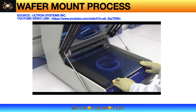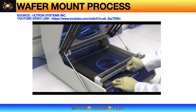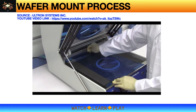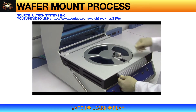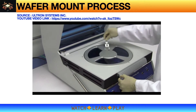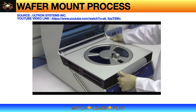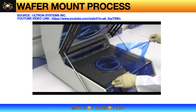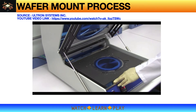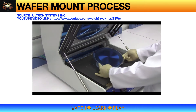Next, pull the laminate roller assembly completely forward and return it to its home position. Close the lid and rotate the circular cutter 360 degrees to cut the film along the film frame. Slide the end cutter, open the lid, and remove the excess unmounted film. Finally, turn off the vacuum switch and the process is complete.